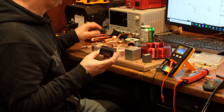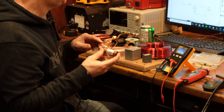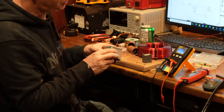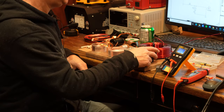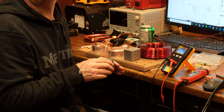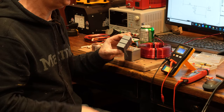We're also going to bypass some capacitors with Miflex capacitors to make them even better. On the midrange side we have MBGO Russian oil capacitors — old stock. They're actually pretty good and not too expensive, and we're going to bypass them with Miflex capacitors as well. On the bass side you need a lot — I need 150 microfarads. If you wanted MCAP Supreme capacitors for that you'd be paying a fortune.